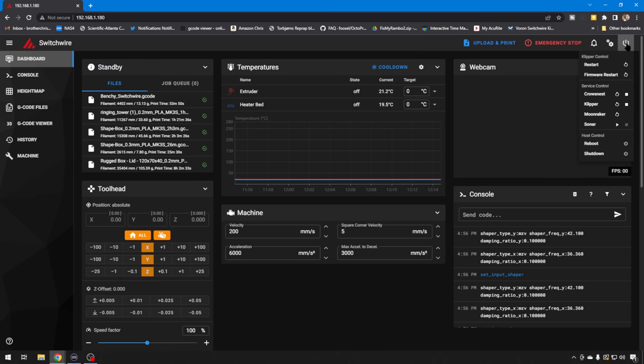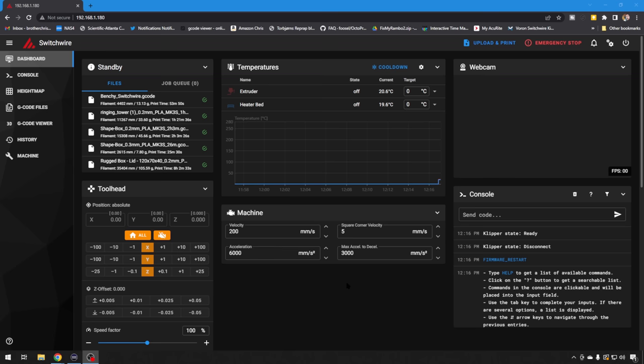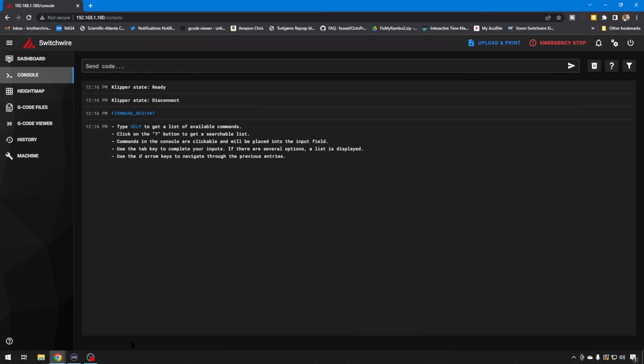I highly recommend at this point, before you start testing different shapers, go ahead and reset the printer in case there are configuration changes put in by either the tests or your config file that you don't necessarily want. Come up here to Power in Mainsail — Fluidd is pretty much the same — and do a full reboot of the Raspberry Pi. It takes a minute, but this will definitely clear out everything. After your restart, we're going to set up to do some of our testing towers. Head over to Console and we'll punch in the commands.